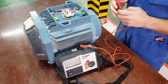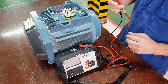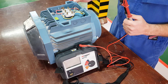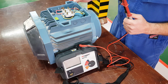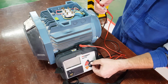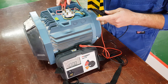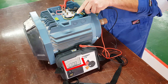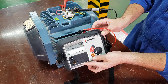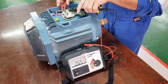What we're going to do is test the winding resistance of a motor — the insulation resistance between the winding and the winding resistance to earth. The motor will be powered down, lockout tag applied, and proved dead using an approved voltage indicator before you would ever connect an insulation resistance tester. The winding resistance will be done on all three windings. Connect the red wire to U1, the black wire onto U2, and read the resistance, which in this case is 2.68 ohms. We have to subtract 0.56 ohms from that, which was the reading we had at the beginning.